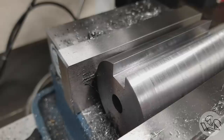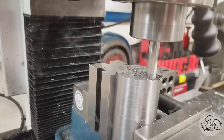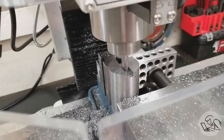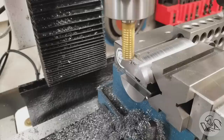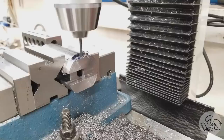One specialty tool I did use were these adjustable parallels — a donation from a viewer, awesome for specialty measuring jobs. There's a similar groove cut down the end to hold one web, and getting this square to the other trench was tricky — watch the full playlist video for that. Once that was cut, I turn it sideways and create a flat spot for set screws to hold the web in place. This is by far the most complex fixture on the project.